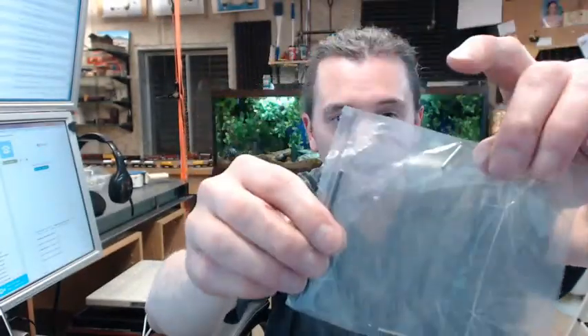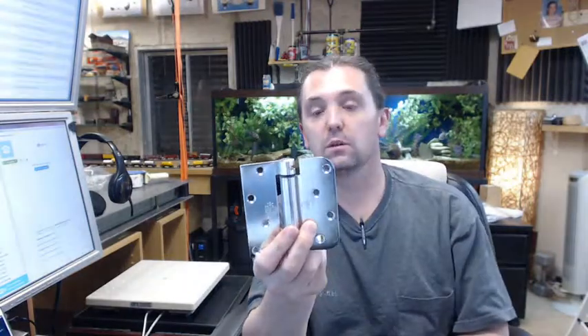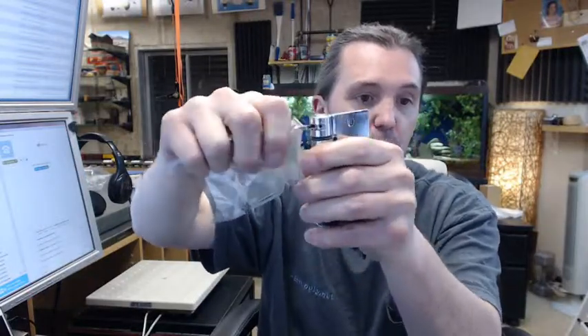A little silver pin. This order actually has two of them because there are two hinges on this order. When the tension collar is pointed up — and that is how you install it — this is an asymmetrical hinge, so if you are installing it with the tension collar up, just reverse it if you are not. Insert the tension rod into one of these holes and turn it clockwise. As you do that, you reveal new holes in the spring tension collar, and it is into one of those holes that you insert the tension pin. If you are installing it in the down position, turn it counter clockwise.